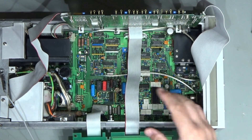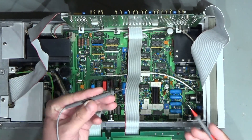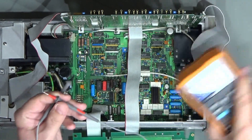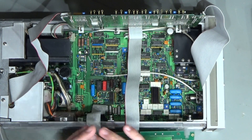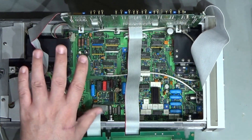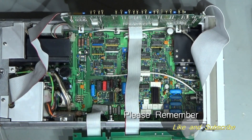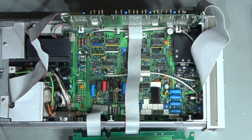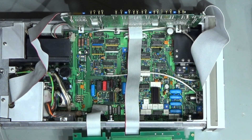Leading into those there were also operational amplifiers and other things that could be faulty. I began my tests as usual — multimeter out, one probe to ground, looking where I could test voltages. We always test voltages first for two reasons: the power supply section holds all the energy, so it's a common place to find faults, especially in older equipment. And without a working power supply you can't test the rest of the circuit.